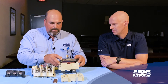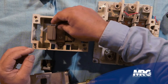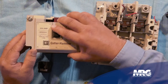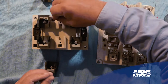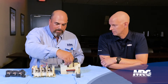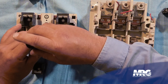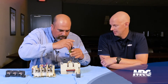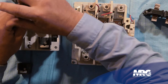That goes back together. Very important: replace the holder for the magnet frame and put that cover back on — this also can only go one way; if it won't fit down properly, it's oriented incorrectly. One of the most important parts is getting these two screws started evenly. Because the assembly has a bit of a lean to it, you want to pull both sides up evenly — do not tighten down one side all the way at once. If you put it in at an angle, it won't hold the magnet frame correctly and will cause problems when your contactor tries to pull in.